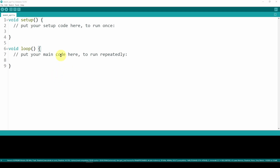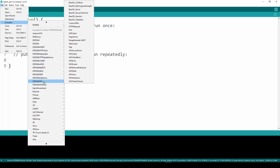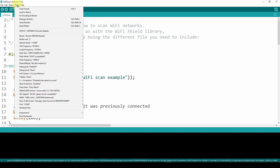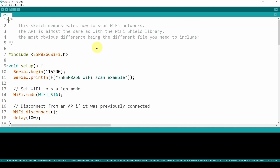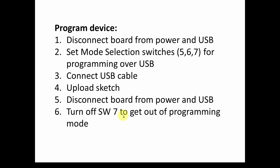There are many Wi-Fi example sketches available. Go to File > Examples > ESP8266WiFi > WiFiScan. This opens a new sketch and maintains the COM8 connection at the bottom. The sketch grabs all sensed Wi-Fi signals and lists them in the Serial Monitor.